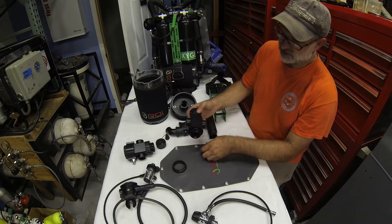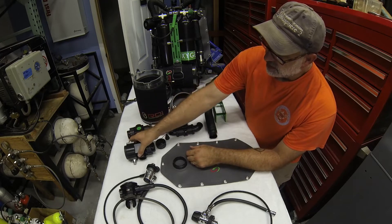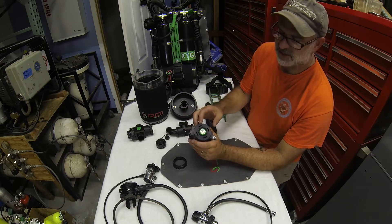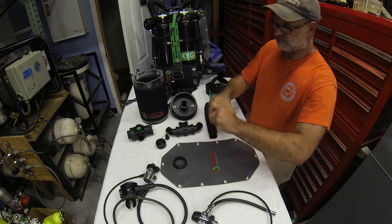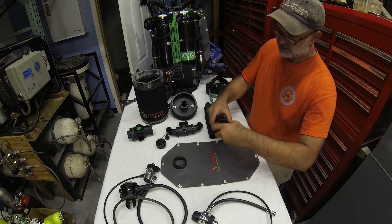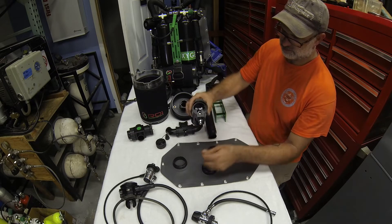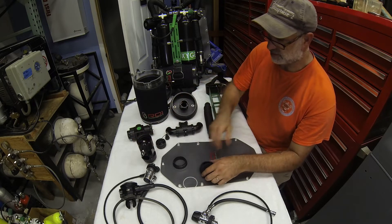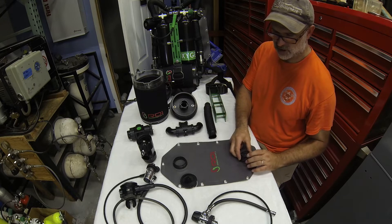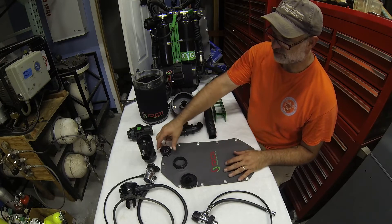There are standoffs so the lungs won't collapse and close off the T-piece. The gas addition regulator is just a standard second stage — dive-shop serviceable with no special or proprietary parts, so any dive shop can service it. On the counter lungs, you can optionally add pressure relief valves or dump valves down low on either side, so if you have a catastrophic flood you can dump the lung.